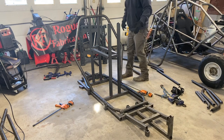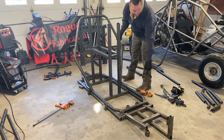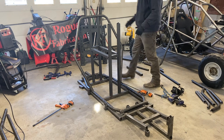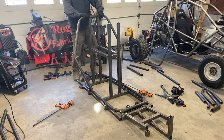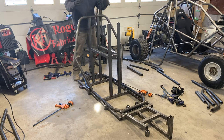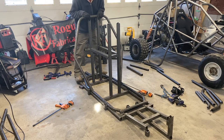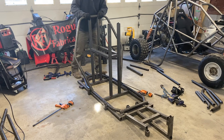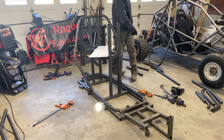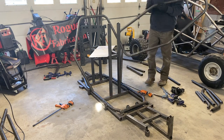It's all squared up. The connection points to the side rails are equidistant from this front tube, and since this is a jig, you can use any point. The top is centered. It all came together with some cargo straps and a little bit of dedication — a tube that was not bent perfectly is now completely square on the assembly. Next on the list is the front windshield slash hood. I honestly have no idea what to name this, so that's the name it got.